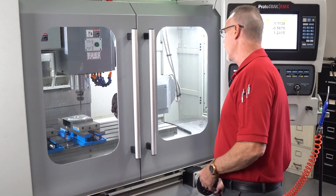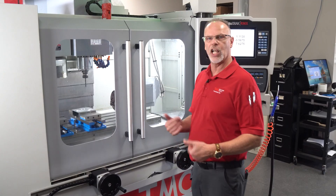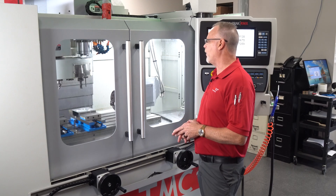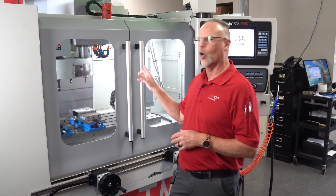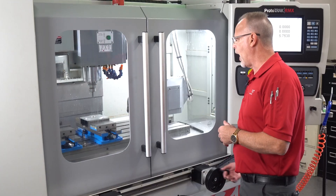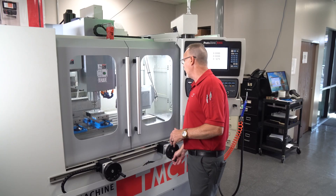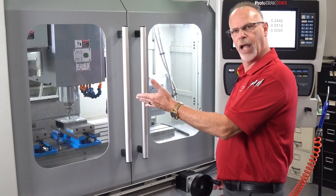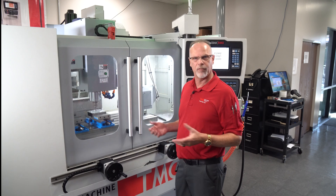It's going to go back up to the top and change back into my end mill. What I also like about tracking is that with every tool on an individual job, I can go in and out of tracking. In this case I'm still in tracking mode — I can bring this tool in, check to make sure my height is good, walk it through the whole program, have it come in and start doing the machining. If I have any questions whatsoever, I can stop, get in, get out.